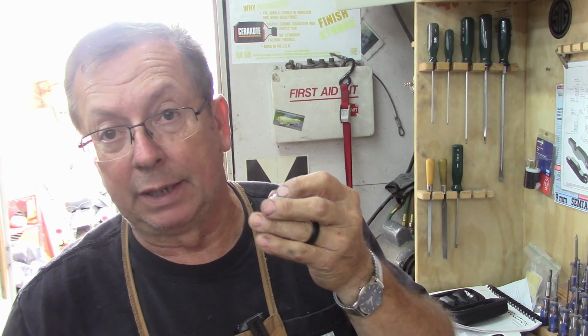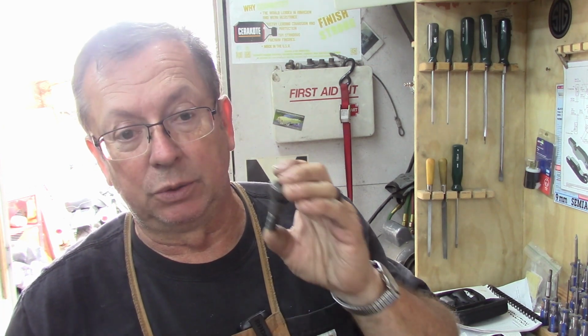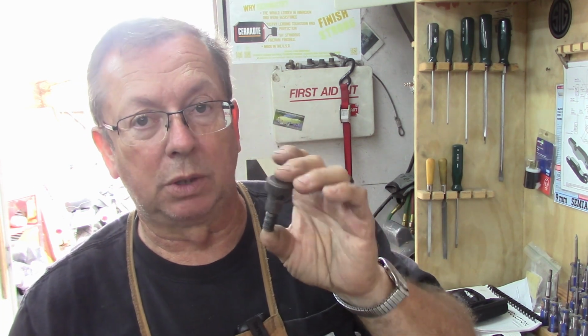And as I looked through the things that I've got to be able to make that square hole at this point in time, I don't have a good solution for it. So I'm going to go ahead and drill these. I think they're 9/32nds, I believe. And then it's going to be some good old fashioned file work to make that square hole. And we'll get that much of it done, and then we'll go from there.